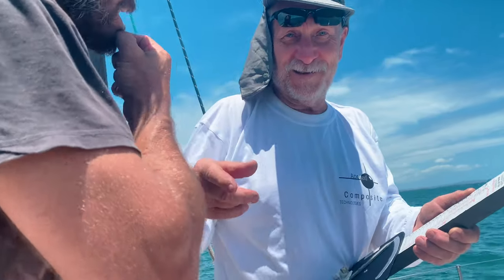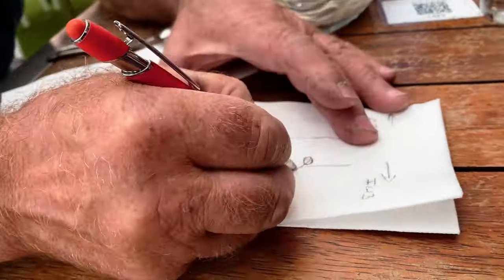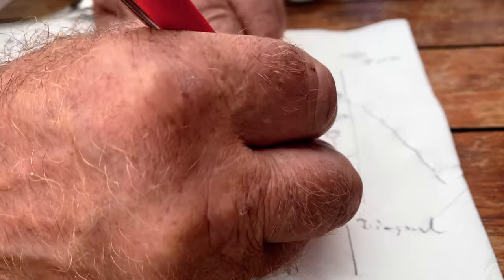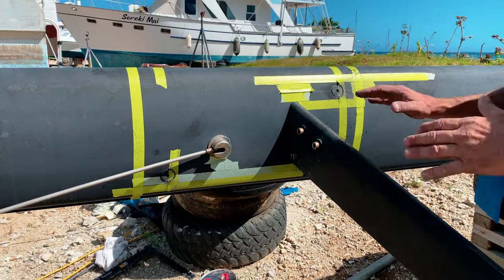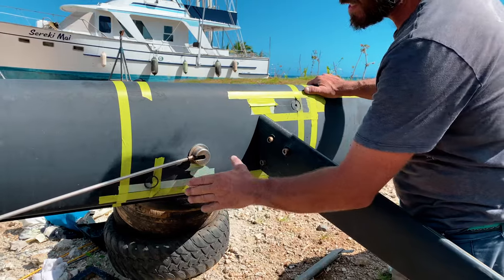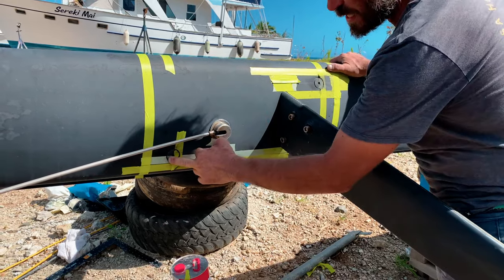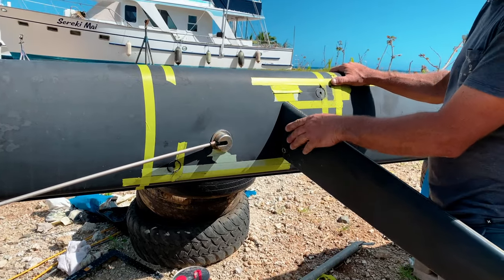We discussed with the builder of our mast the best place to drill the holes for these attachments, and he explained that the mast had been reinforced around the position of the spreader. But remember, here we've got about 200 reinforcement, and here we've got about 400 full body reinforcement. The mast builder, the guys who made this mast, gave us the exact position where there is the reinforcement and where we can drill. And the additional stay and running backstay don't give any kind of fragility to our mast.